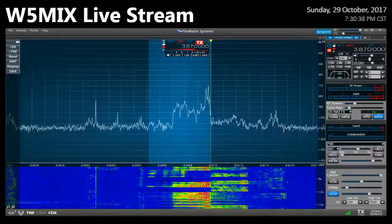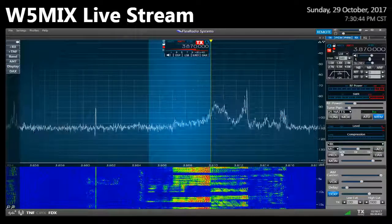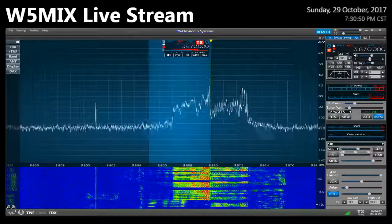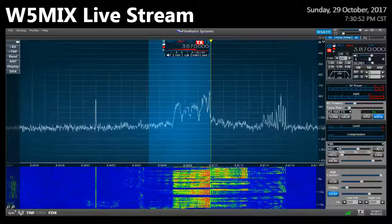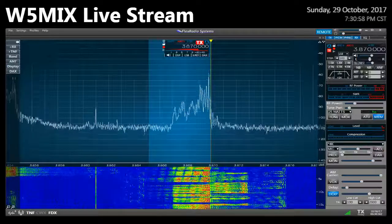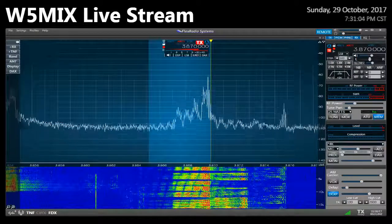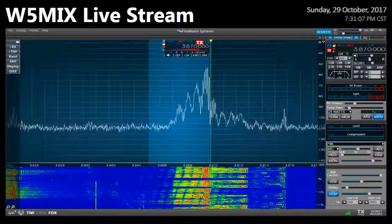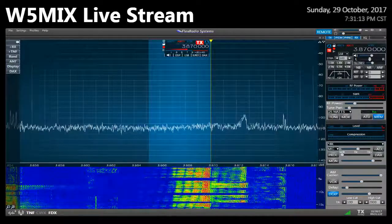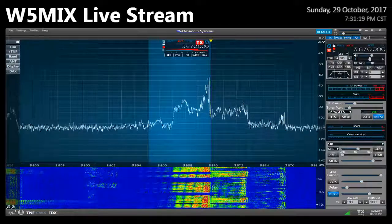And then I said, well, it must be something mechanical inside. So I opened it up, started poking around, and I found one of those multi-pin inline jacks, cable jacks, in the middle of the main board. So I tapped on it, and it started flickering on and off. I go, I think I'm getting warm. And I finally tapped on the connector right in the middle of it. And the radio cut off, and when I'd wiggle that one connector back and forth, it'd turn on and off. And so I pulled the header apart and crimped the connector better and shoved it back on there and never had that trouble again.